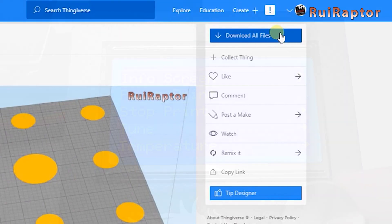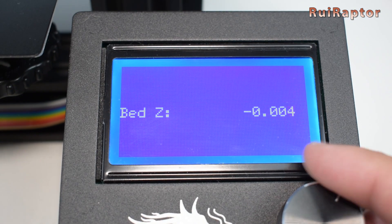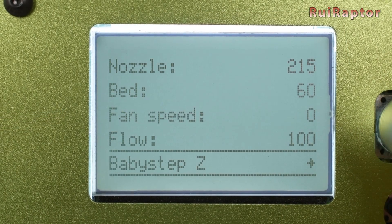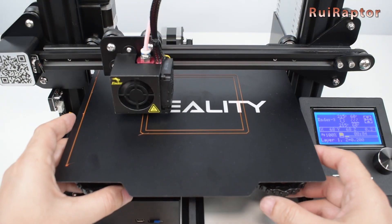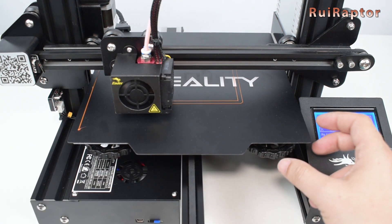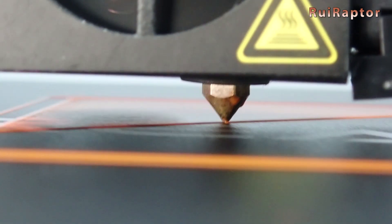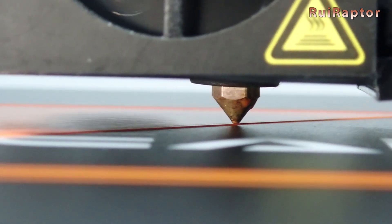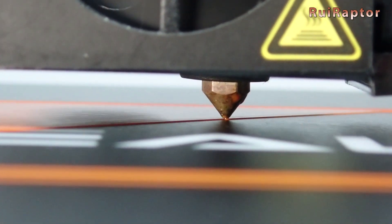While printing the patterns, you will probably need to make some adjustments. You can use the bed Z value to correct the height if you are using the manual mesh leveling, or the baby steps feature if you are using a leveling sensor. When adjusting the height while printing, try not to use the knobs to make this adjustment. Adjusting the height with the knobs while printing is a handy technique, but when using manual mesh leveling or auto bed leveling, this will mess with the leveling of the bed and ruin your mesh.